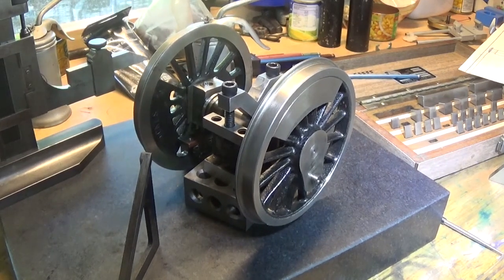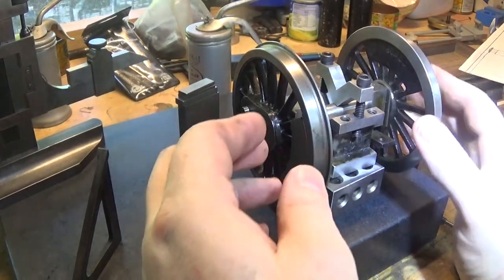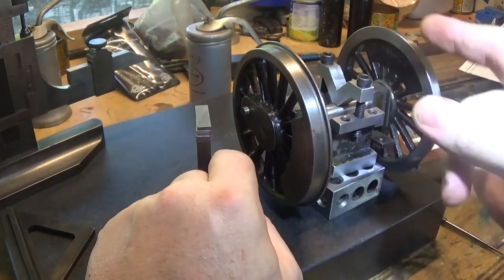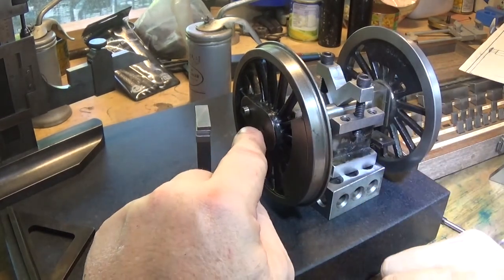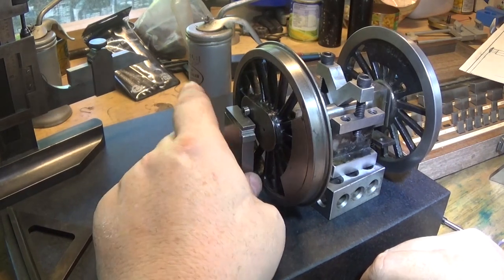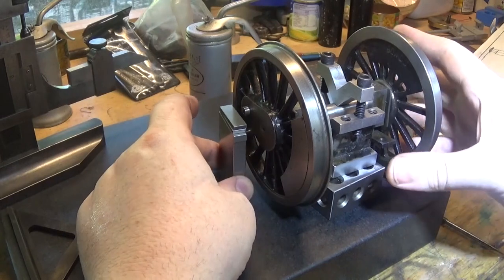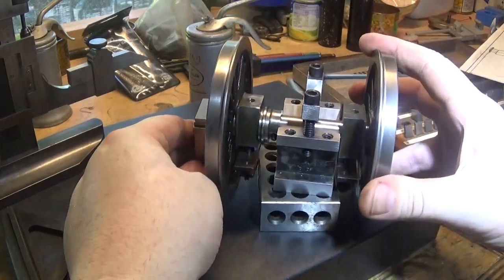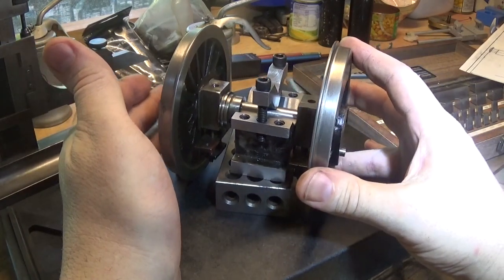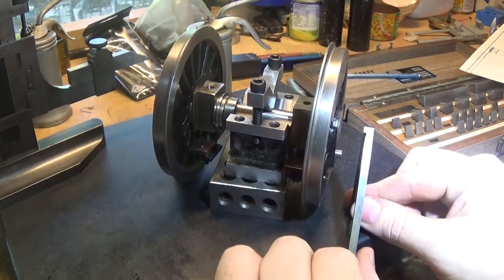And quarter them up right. What I've done is measured the centre of the axle — or measured the top of the axle and divided it by half the diameter — found the centre, and then made a gauge box stack that's just exactly right under that crankpin. Now that's not at 90 degrees there, but if we set this other side up with a little square, we'll move this back here so we can, without knocking our gauge box stack off, set this side up with a little square.